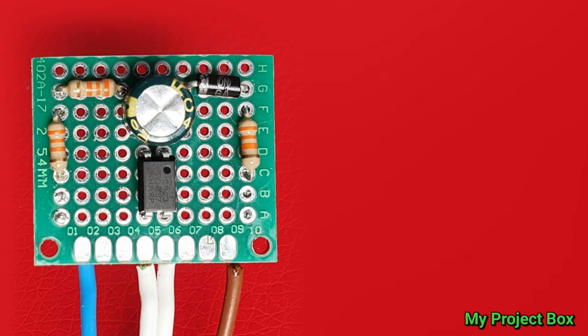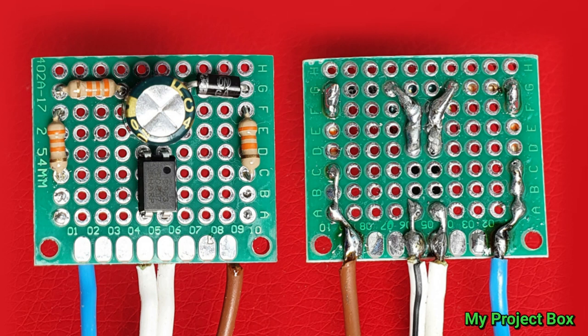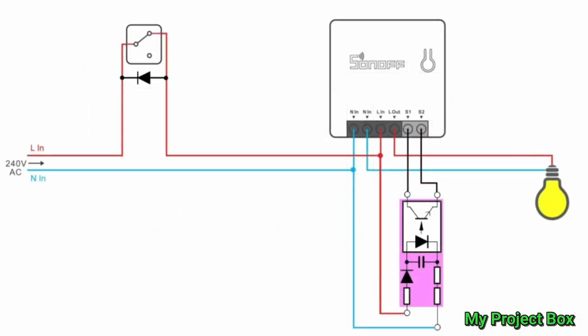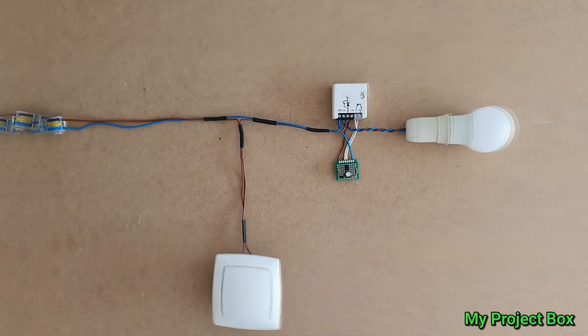The circuit is incredibly simple. I've put the optocoupler on a bit of prototyping board in the center and based the other components around it, with spacing between the high and low voltage sides around the optocoupler, so there's plenty of clearance between the high voltage and low voltage sides of the circuit for good isolation. This could probably be done with surface mount components to make it incredibly small - possibly small enough to fit inside the Sonoff Mini itself - and if you make it small enough you can wrap it in heat shrink sleeving for better isolation. Let's connect it all up, lay it out, power it up, and do a practical demonstration.